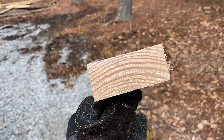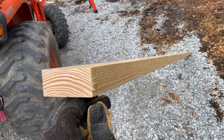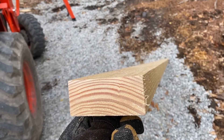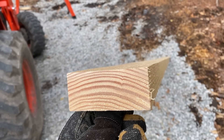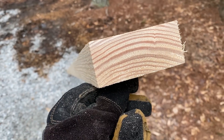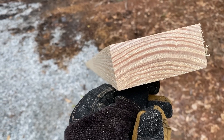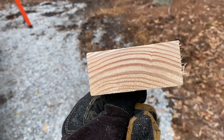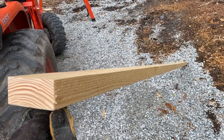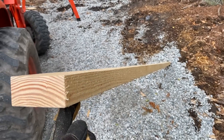Here's some bonus footage for people who appreciate good lumber. I just cut this 2x4 — it's 10 feet long. Incidentally, if you try to buy this at the store around here it's going to be 11 or 12 dollars, which is ridiculous. But one thing that jumped out at me: look at all those rings on the end — I counted 12 rings across that board up in the corners. A typical store-bought 2x4, you'd be lucky to see four or five rings. Just amazing quality — this is the kind of lumber you can produce at home with your low-cost sawmill.